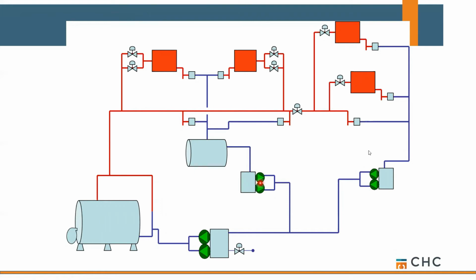So a couple other things. You'll notice if you've got long horizontal runs in your steam distribution lines that you might have what we call a drip leg. Anytime before some type of reducing valve or control valve, you tend to have these things we also call drip legs, okay? And if you think about steam flowing through our system, if it's moving at 50 miles an hour through our system, and all the heat exchangers over to the right here are satisfied, this valve would be closed. So you've got 50-mile-an-hour steam that's hitting a stop sign. And part of that steam is going to cool and condense, give up its energy, turn back into condensate. So in order to protect this valve, you have to be able to get the water or condensate out of that system. So that's what we're doing with the drip leg.